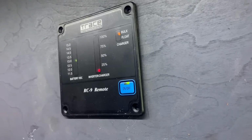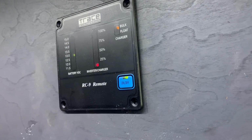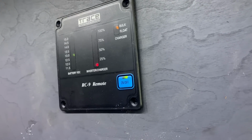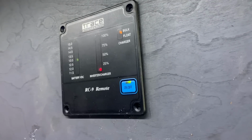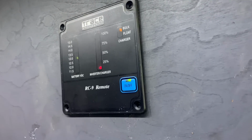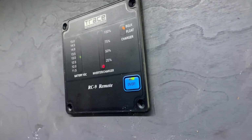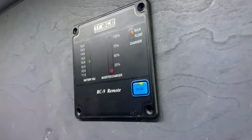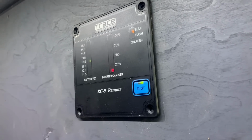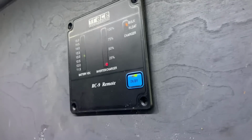So I'm going to leave it on here for a little bit, and I'll come check it every hour. But even when it's plugged into 110, it's passed through, it was shut off. And I just tried to plug it in at home, at the bus, and it kept tripping the ground fault. I don't know why. It would run fine off the generator, and then I went to a non-GFCI outlet. That's what it's on now. So anyways, that can't be safe.